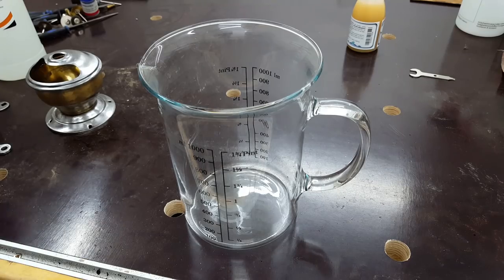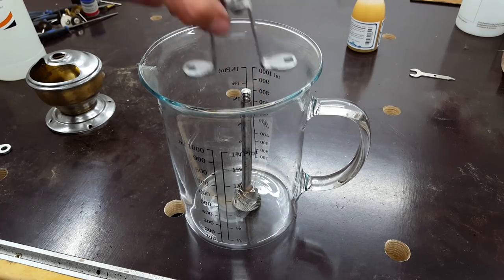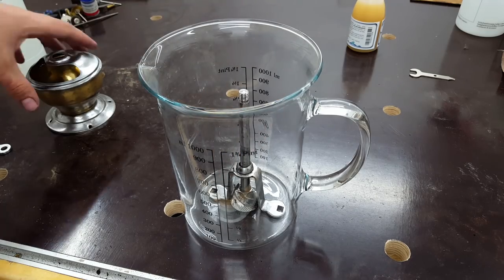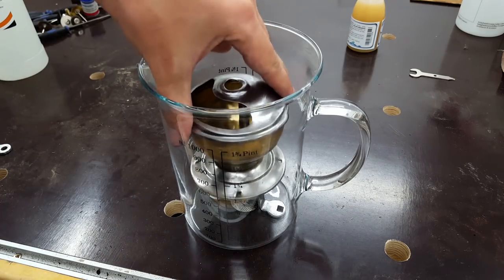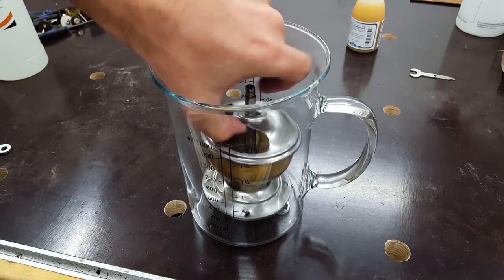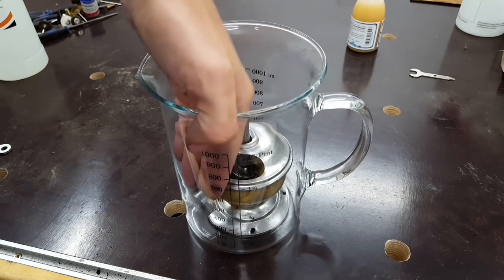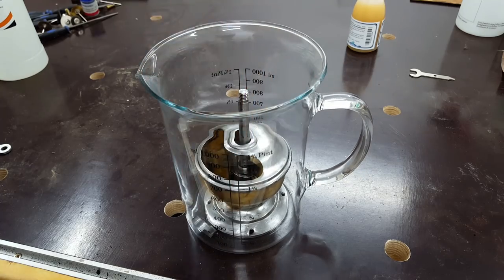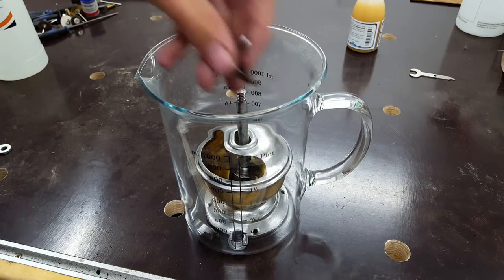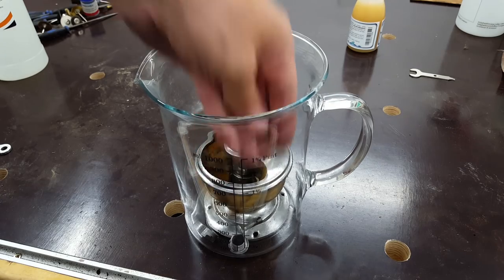And this is another detail that I spent extensive research on. Originally, all metal parts, except the grinders, were nickel-plated, with a galvanic, aka electric process. This gave them a chrome-like, shiny finish, but this kind of look requires a spotless surface finish of the base metal. However, because of corrosion, the surface of the bean chamber had become quite rough, and polishing it would have meant to remove a big portion of the very thin material. So that wasn't an option.